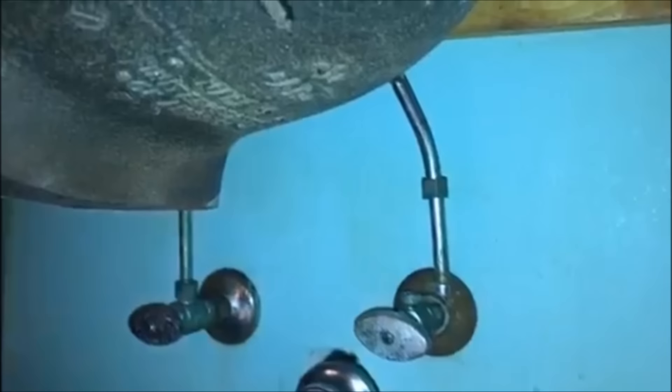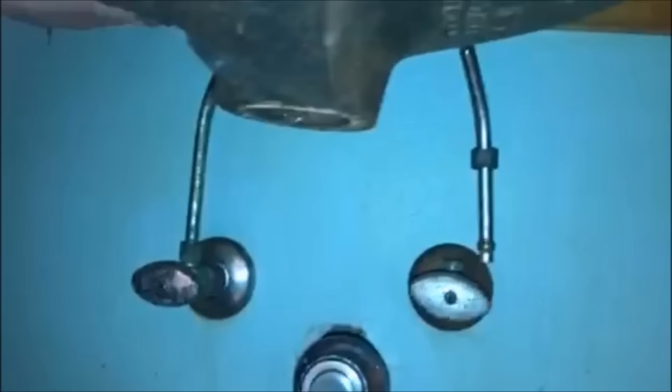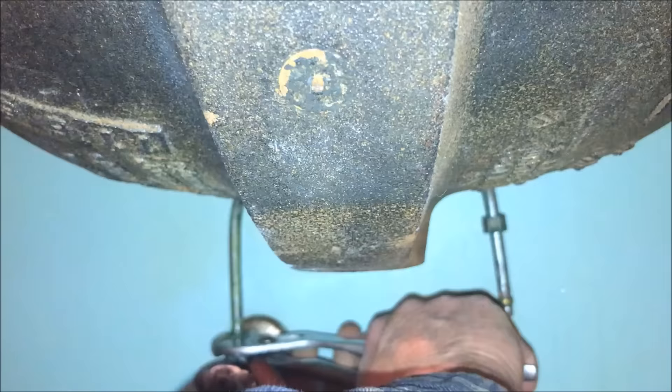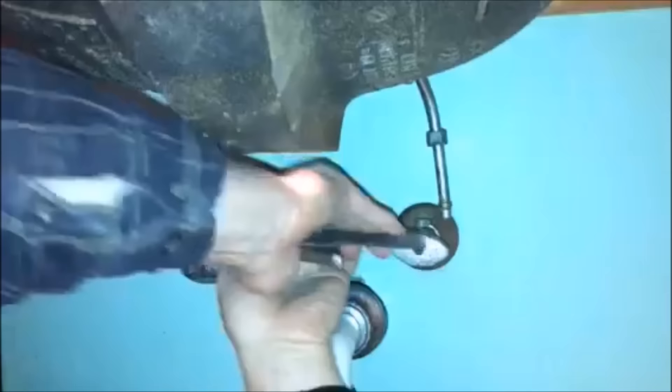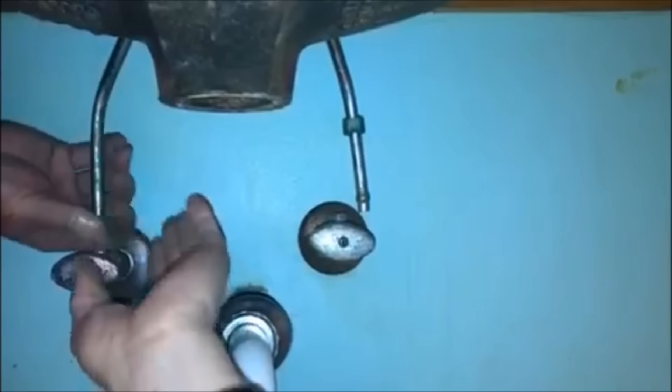With the copper tubing, you've got to pop it out. As you can see, we just pulled the copper tubing out. Now if you're just removing the faucet you would have to unscrew these bolts, but we're removing the sink and the faucet so you can just take these off, remove the faucet, and replace that. We're putting in a whole new sink so we don't need to do that. Now the other compression bolt we're just going to remove that, and again once you get it loose you can do it by hand.